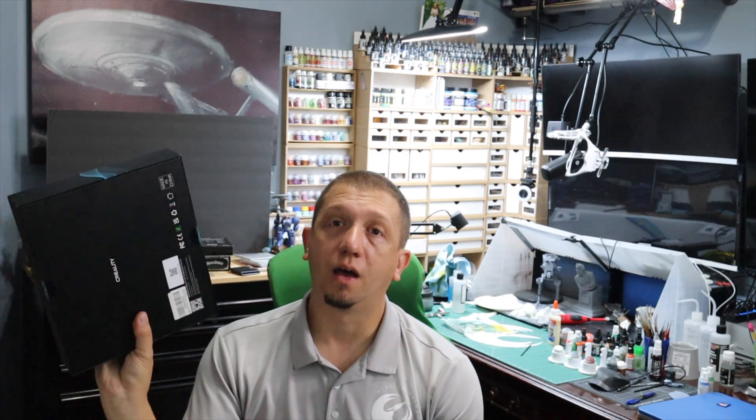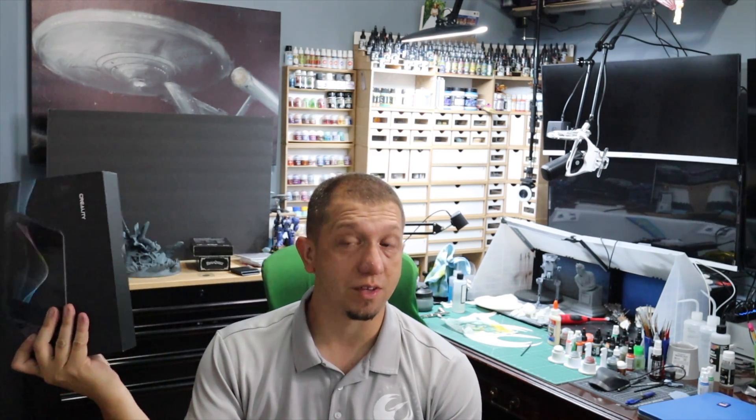You saw on the machine we can adjust our Z offset and all this kind of stuff within the device. Honestly, before I did the firmware, the S1 Pro — I could do that on the small control screen. But the Klipper software gives that little bit of enhancement, that little bit of speed boost, and a little bit of extra control. So is the device worth purchasing? Yes, it is. Getting control over your printer and the Klipper feature to help enhance the Creality printer is actually really nice. This one I'm holding is for my CR-M4 — I'm getting ready to tackle that one, but I've had a lot of jobs the CR-M4 has been handling, so I haven't had the downtime. Setup on the Ender 3 S1 Pro took about an hour to go through the full setup, including flashing the firmware to the printer.